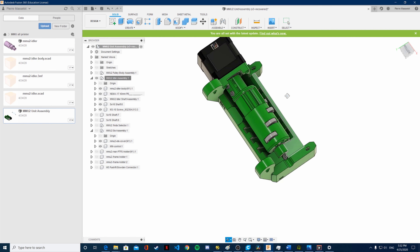In order to do that, there are a few things we are going to do. We are going to have to increase the size of the hole for the bearing, but also push the bearing a little bit back. There is a small gap between the part where the bearing sits and the extruder, and if we have bigger bearings, this part is going to be blocked off and we won't be able to put filament in there.